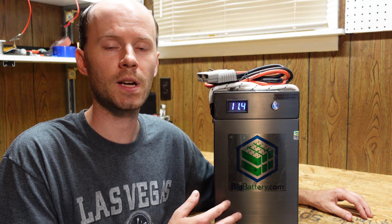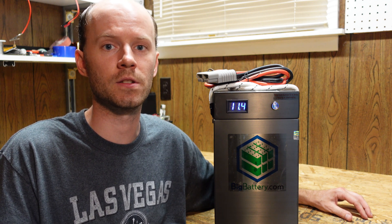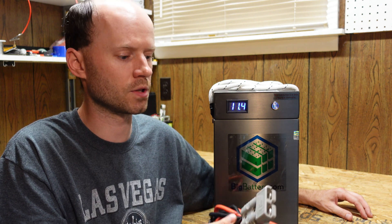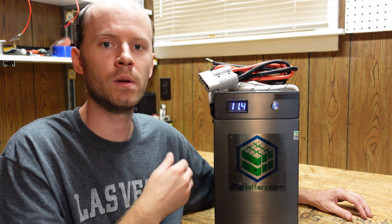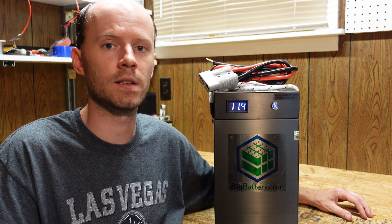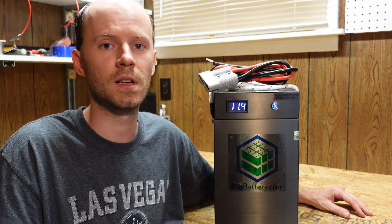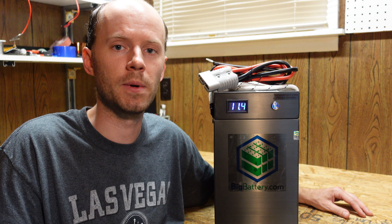This video was not sponsored — I purchased this battery myself, taking advantage of a 10% off plus free shipping discount code Big Battery had running. My only recommendation to Big Battery: I love the silicone wire cables you sell, but it'd be great to offer a 4-gauge variant in the store alongside the 6-gauge option. Knowing these batteries are capable of 175 amps, I'd personally opt for 4-gauge. If you liked this video, please hit like. I'll leave a purchase link in the description, and affiliate link purchases help me fund more reviews like this. Let me know in the comments if there are any batteries you'd like to see reviewed — thanks for watching.